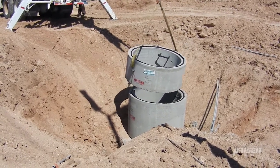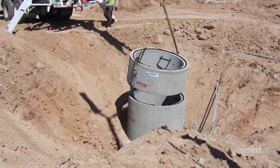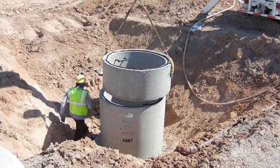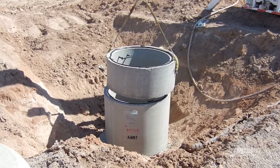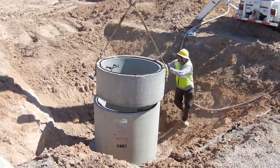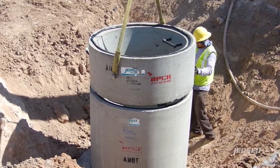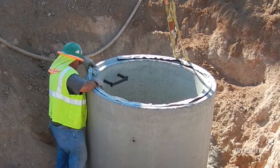The crew member will visually assist the boom operator in guiding the manhole section into position over the manhole base. The crew member is required to pass training for a qualified signal person prior to assisting the boom operator. When the manhole section being lowered is within 12 to 18 inches of the top of the base, a crew member enters the excavation to line up the outside marks on the manhole section, which mirrors the step location on the inside. The manhole section is lowered into place, and a team member then installs mastic sealant around the top of the manhole section.